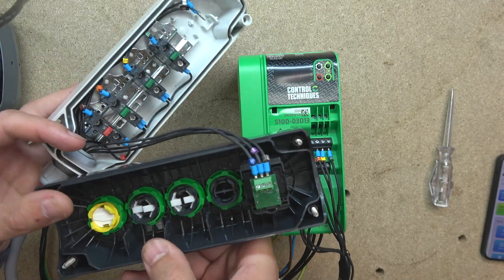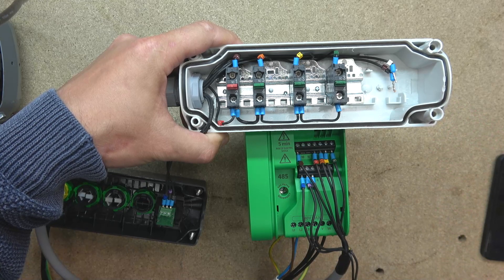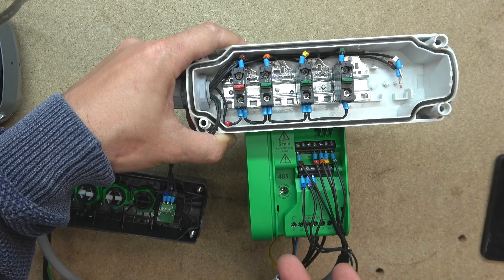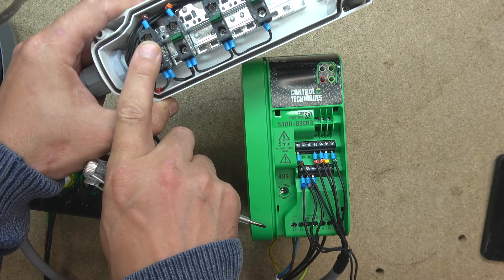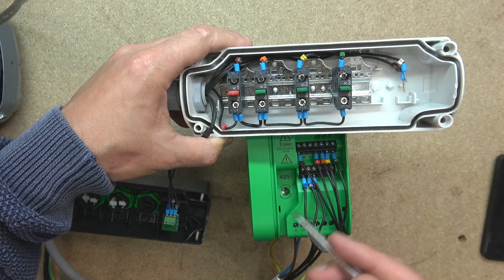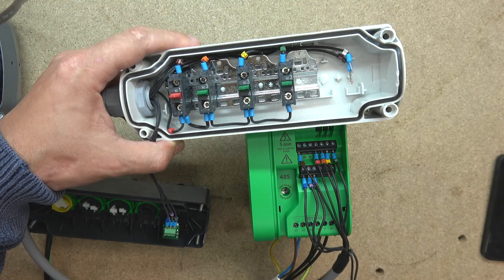Here we are. My potentiometer has terminals one, two, and three — all coming in here, as we've seen from the wiring diagram. For the switches: my number one cable is terminal 9, coming to my e-stop, going via the e-stop and going to my enable. Because the e-stop is not pushed, the drive will be able to run. If the e-stop is pushed, the drive will not go. You can see it change from inhibit to ready. After that it's quite straightforward — the power comes through the e-stop, goes to all the switches, and each switch sends signals back to the correct terminal block as shown in the diagram.